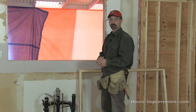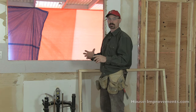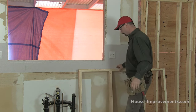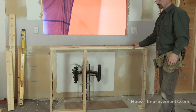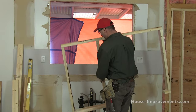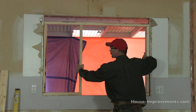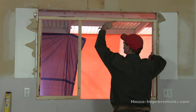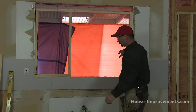I've got most of the frame already built and ready to pop into the hole. Today we're mostly going to deal with filling that hole in and getting the plywood on the outside. I've got most of the pieces pre-made, so I just want to quickly fit it into the hole to be sure that it's going to fit. It will be a little bit short from the top and I'll show you why in a few minutes. There's going to be another framing member here, another one over there, and one across the top — I've left those out because I need room to fasten this frame in.